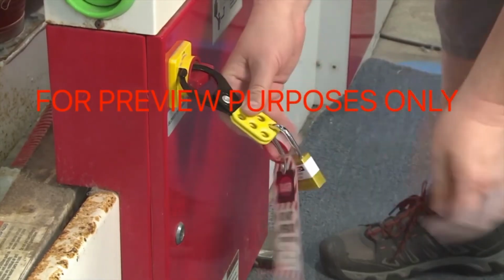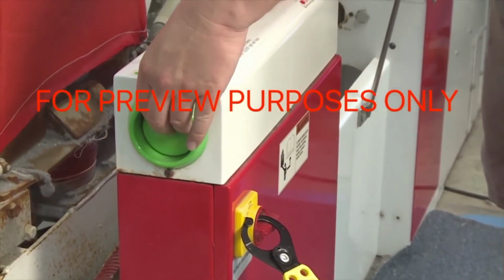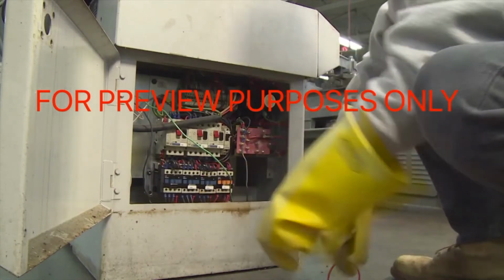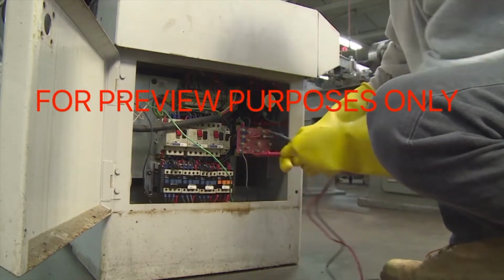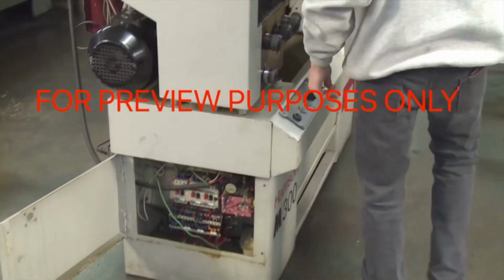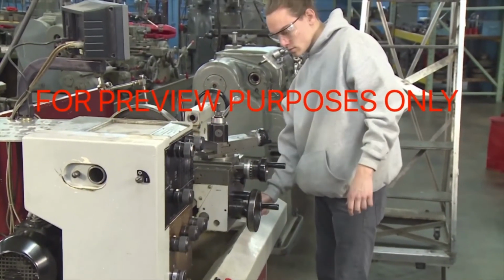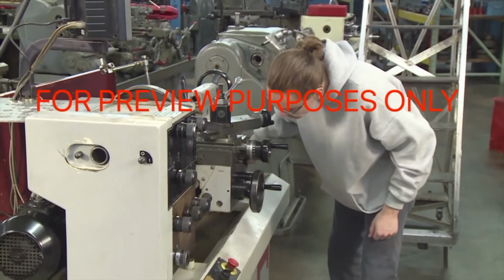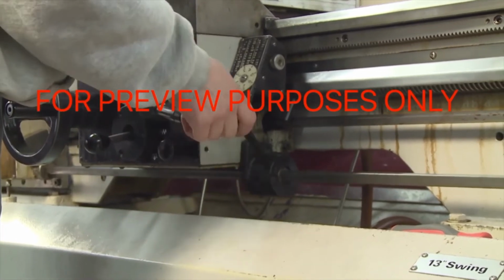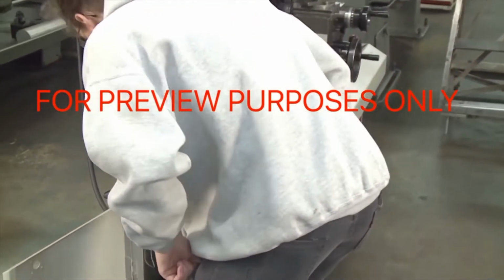Once you have performed all of your lockout-tagout and energy dissipation procedures, you should test the machine to make sure that it won't operate. For electrical systems, you may first want to use a voltmeter to double-check that no electricity is flowing. Next, press all start buttons and throw all switches and levers that would normally be used to activate the equipment. After you have determined that your lockout procedures are working, return all of these switches to their off position. In most situations, work can then begin on the equipment you are servicing.